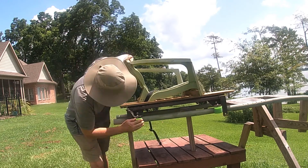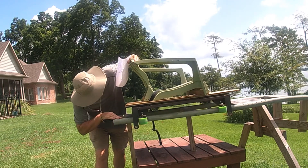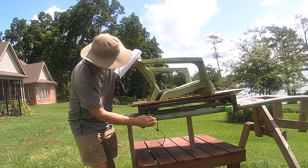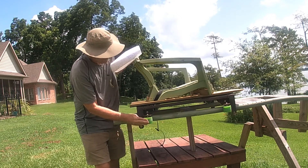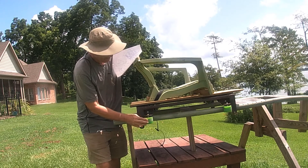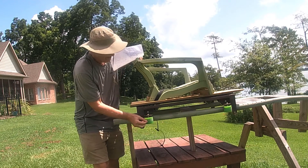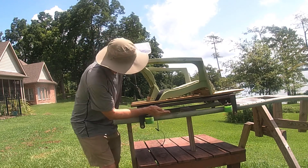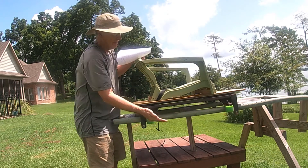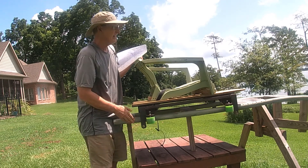These wheels — these are skateboard wheels. There are wheels that roll on the track right under here, and then these are side wheels. These side wheels are a lot bigger than they really need to be. A lot of people would just use roller blade wheels here, but I was afraid that the roller blade wheels would crawl up the pipe down there where it dips, so I went ahead and used these even though this increases the friction.